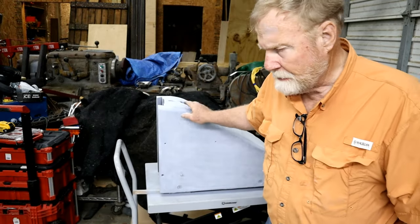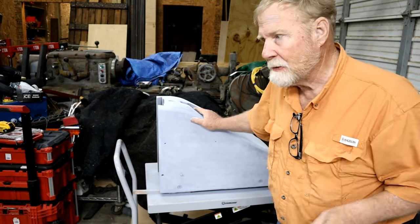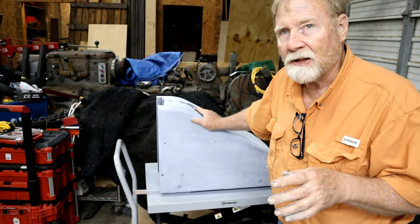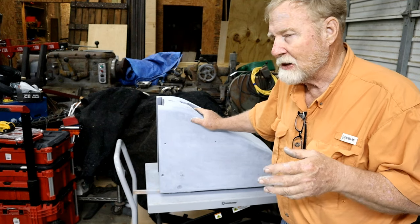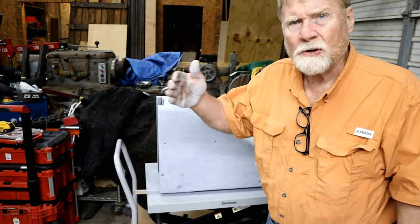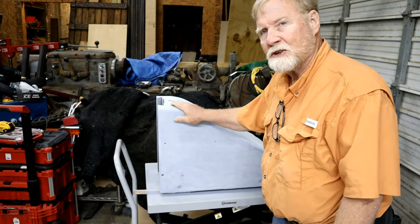The table's all planed. Got a 4-foot angled straight edge that's been planed, and I've got to scrape both of those so I can use the straight edge to check the table. And then I'm building this Kingway alignment tool, and that's finished, that I needed to use to check the level, the straight edge, and then the table. So it's kind of all a process, and after a while, it just starts adding up time and time. God, that's smooth.